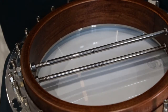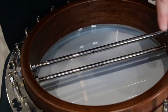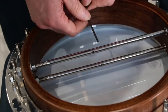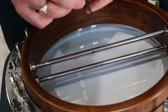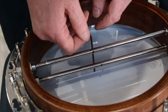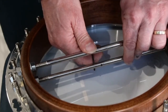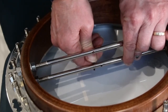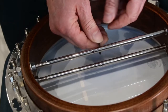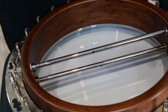The first thing I want to do is check the general tightness of these two rods — both should be fixed securely at this end. The best tool I've found for this is an allen key, because with a screwdriver on the bottom rod you haven't got much adjustment, but with an allen key I can put it in the short way round. I'll brace my thumb on the top rod and check for movement — there's just a tiny bit but that could give it extra security. The top rod feels pretty solid so I'm happy to leave that.